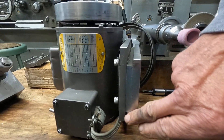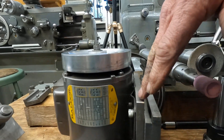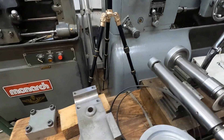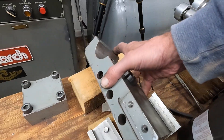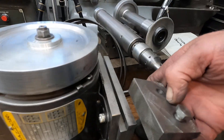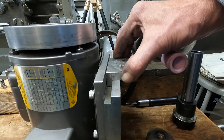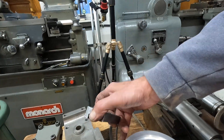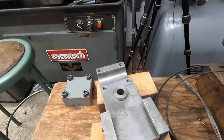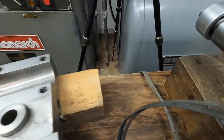Here's how this thing mounts. I've got this plate with two slots here — that's the adjustable plate. Then I mount the motors to a half-inch plate that bolts to this plate. That plate slides into these slots. Once these slip in and grab on each side — just like a claw on each side — and then when you tighten these bolts, they grab. That fits under that lip there.